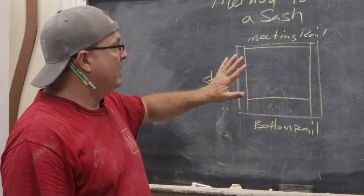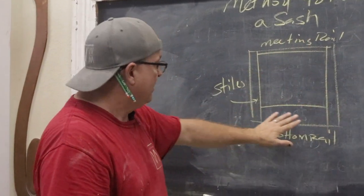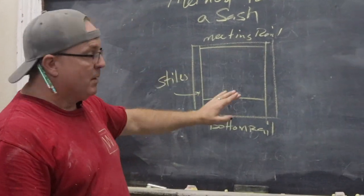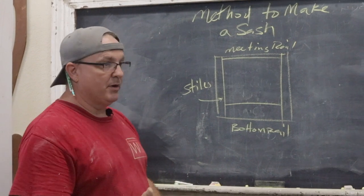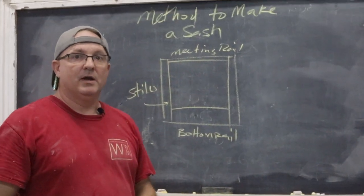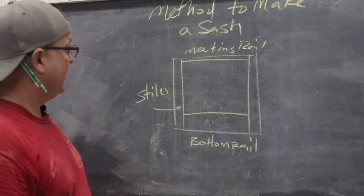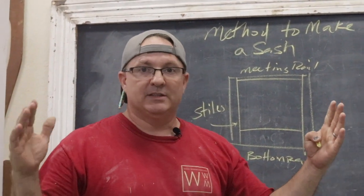I'm going to split this up into just a few basic activities. Before you can really even make these pieces, we're going to start with rough lumber and mill it down to what we call blanks. Blanks are each individual element properly sized — thickness, width, length — out of which you can then cut your joinery. We're going to split it up into stiles, and then we're going to do rails one at a time. So first things first, let's go cut our rough lumber to an approximate size to give us something to work with.